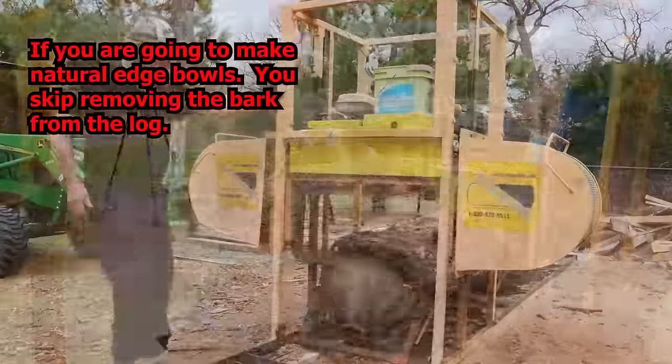They've been laying out here about 4 days since we did the second inspection and grading and then put the extra anchor seal where needed. I just got through going through every one of these. They don't need any more anchor seal. None of them have shown up any problems. So out of 22 blanks, the two blanks that we rejected last time are the only two that failed the test. Everything else is quality bowl blanks, and they're ready to go on the shelf.